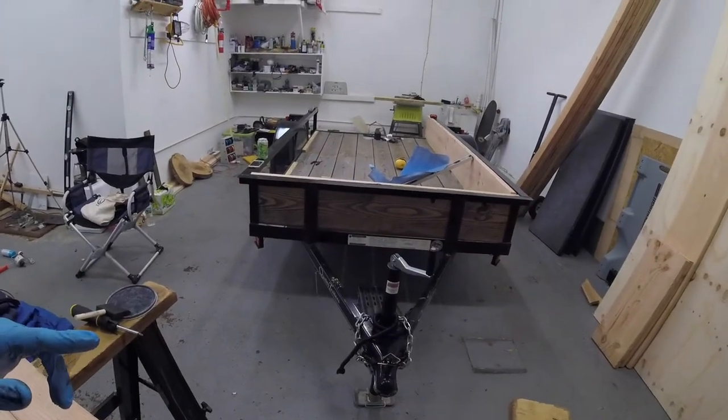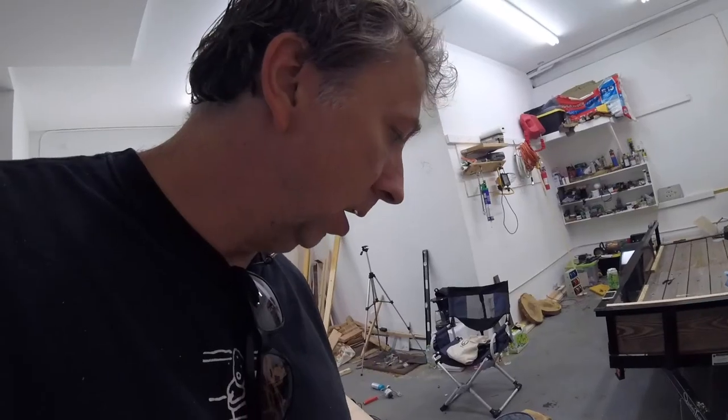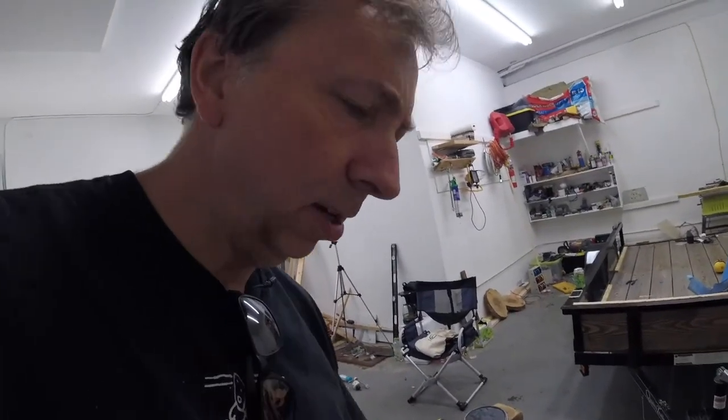It didn't quite turn out the way I wanted it to. That right there — that's what it looks like. That's supposed to be semi-transparent, and to me it's like barely grayed. But this is just kind of how it goes sometimes. Not everything in this build is going to be perfect, not everything's going to turn out exactly how you want it — you just have to kind of roll with it and expect that the aggregate will look awesome. Anyway, the side pieces are next. One thing to mention: make sure there's no writing or blemishes that are going to show on the board, because it's going to be facing the outside. If there is writing or something stamped on there, you might want to sand that off before you put the stain on.